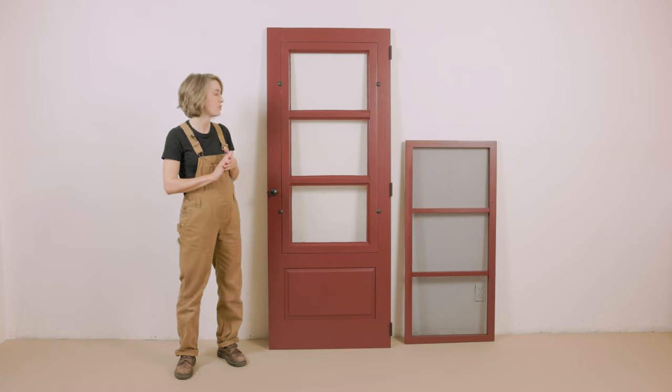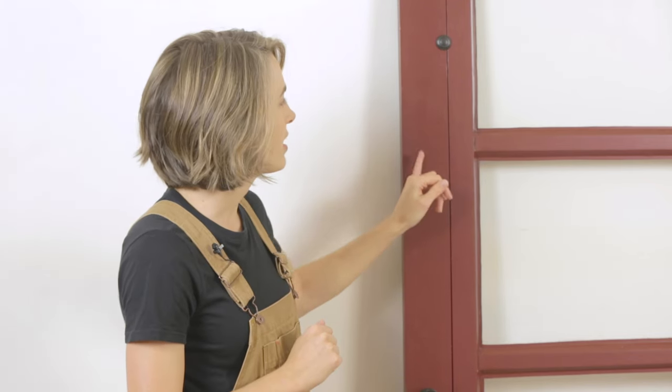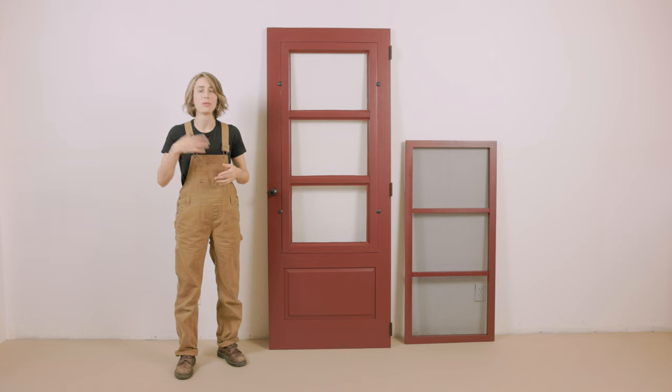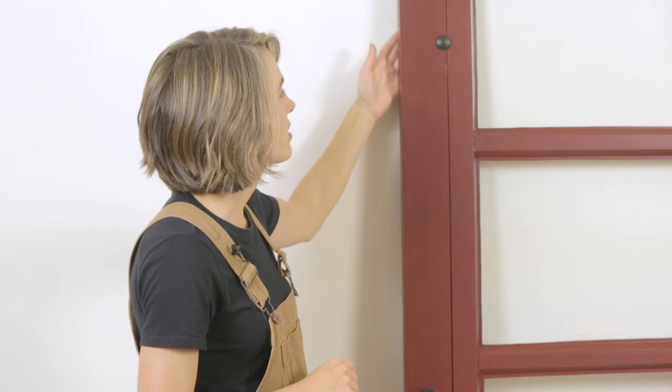It's been a couple days and our final coat of linseed oil paint is fully dry and we're ready to install the screen door. To recap, I've applied a 30% paint to 70% purified linseed oil primer coat on all bare wood surfaces, then finished with two undiluted coats of linseed oil paint. I've followed the same process with both the summer screen insert and the winter glass insert. Wherever the inserts meet wood-to-wood, I just wiped on that 30-70 primer to avoid building up the paint film and causing the inserts to stick — so keep it nice and thin on those surfaces. The reclaimed screen door hardware has discs on the exterior side and a screw feature on the interior side; they use pressure to hold the inserts in place and make the seasonal swap nice and easy.